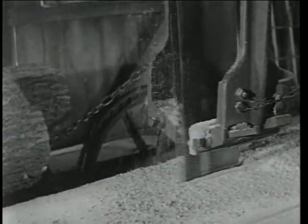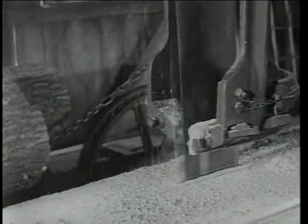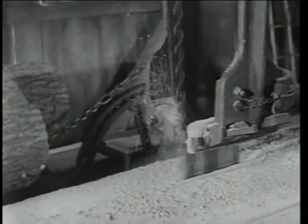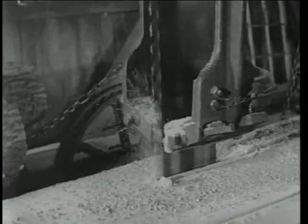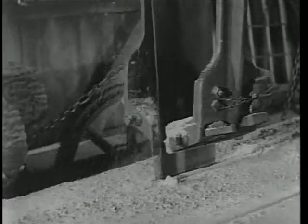The bottom of the saw blade is fastened to a beam, but the top of the blade runs free. Wooden guide blocks above and below the log keep it running straight and confined to its track. There is a slight jerk back when the saw moves up, clearing the teeth from the log, so it is free in the upward stroke. The incision created as the saw moves through a log is called kerf. Vertical lines, called furrows, are etched onto the boards by the up and down motion made by the heavy saw teeth.